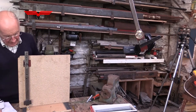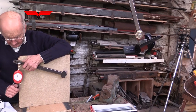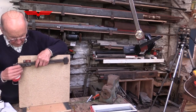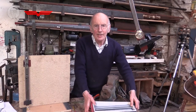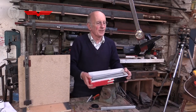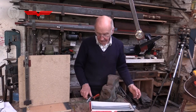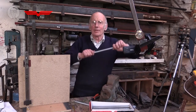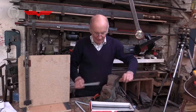And of course, for any mechanism you can measure what the force is just with a spring balance. So in this case, it's about 2.5 kilograms force that I'm looking for. But I don't usually buy springs from spring catalogues. I just occasionally buy this box of 12 inch continuous length assorted springs, and it's wonderfully good value. It's about 40 quid and you get lots and lots of springs, and they vary widely in how strong they are. So then you can just play with them and decide that one feels too stiff, and that one feels really stiff, that was definitely not going to be any good.